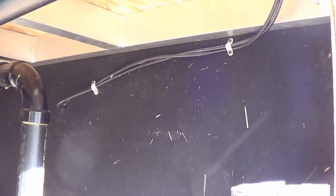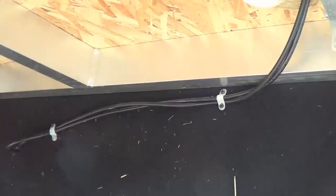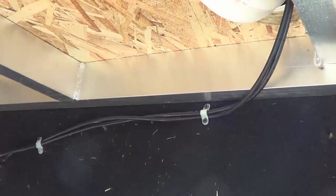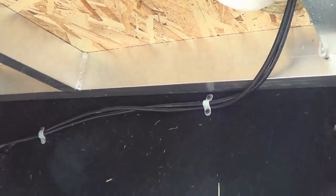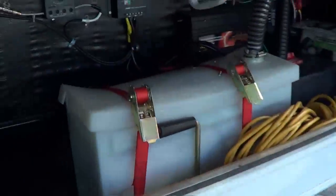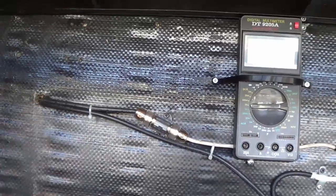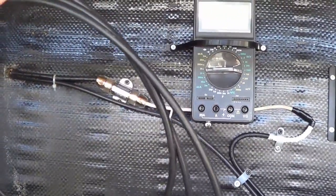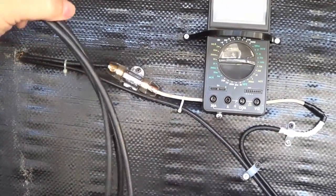A little update to my grand plan here. I got to thinking and figured out I made kind of a boneheaded error when I ran the wire down from the bathroom into the basement storage. I didn't need to go through the propane area — I could just drill the hole and run it straight across to the other side. I was worried about having electrical wire running through where the propane is. The odds are that propane won't leak at the same time I get an arc off the wire, but from a safety standpoint it's better to keep wires out of there. So it pops straight out through the wall there, saving about ten feet of total wire off my run — and the shortest route is always best with solar.